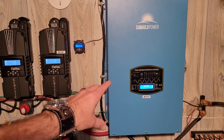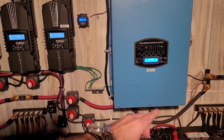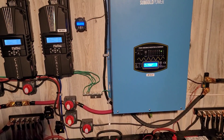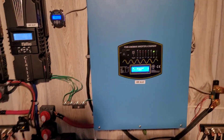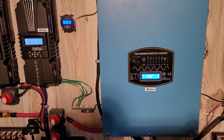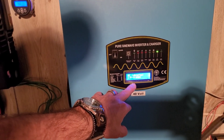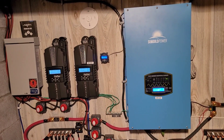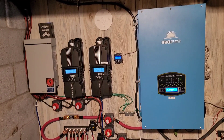I'm getting ready to do a video in the next couple of weeks where I'm gonna utilize the internal MPPT controller inside this inverter — gonna wire up some panels, probably 215-watt panels, into the charge controller that's in here and see how well it actually works. I couldn't be any happier with this 12,000-watt inverter. It runs the whole house — washer, dryer, 150-foot deep well pump, freezers, refrigerators, lights — everything. We haven't even hit 50% capacity so far, even with the wash machine running during the daytime. It's about $2,700 but absolutely money well spent.